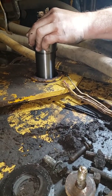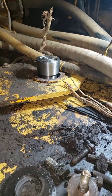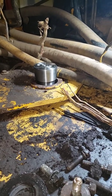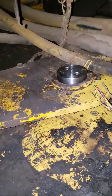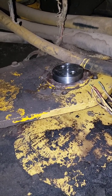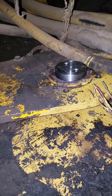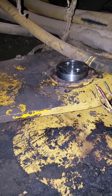We're getting ready to drop in the top center pin. That drops in and then a plate goes on top of it and aligns everything to the mainframe. Once it finds center, it starts to go in pretty smoothly. You've got to watch your clocking because your bolts from the center pin have to line up with the bolts on the mainframe with your plate. You've got to make sure you've got it in the right orientation, otherwise you're not getting your bolts in.